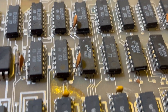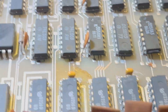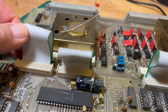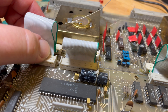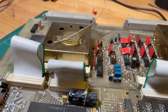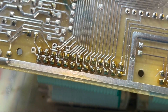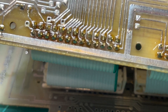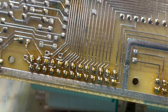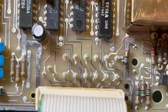I've replaced those three with some modern little MLCC 100 nanofarad caps. I'm not a fan of these ribbon cables since they can't be removed - it would be nice to replace them with normal 2-by-whatever headers so you can unplug the ribbon cable and separate the boards. It'll probably be Soviet 2.5mm spacing rather than the standard 2.54mm, but I'll worry about that later.